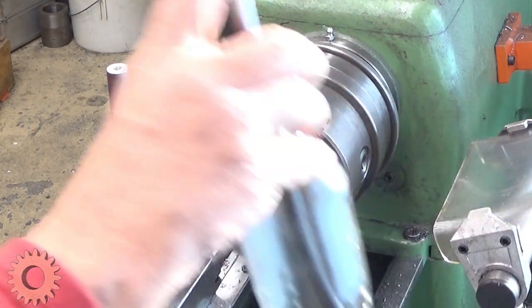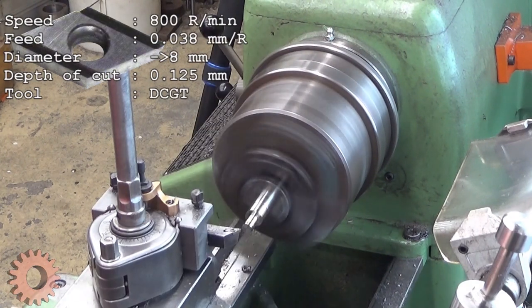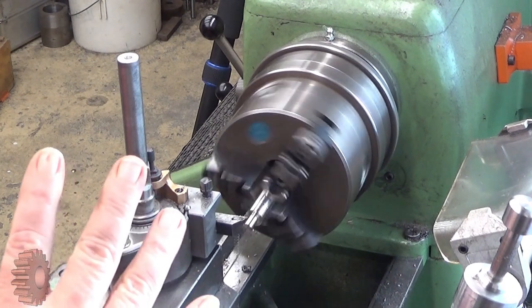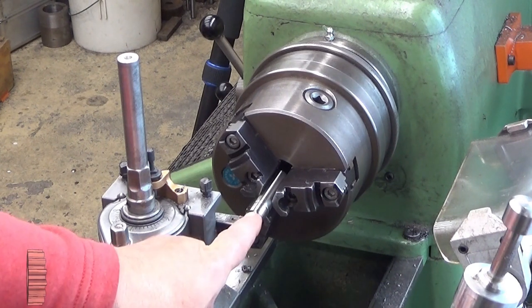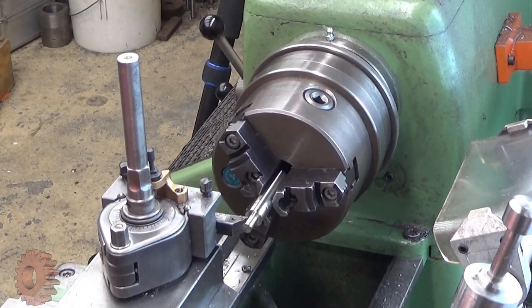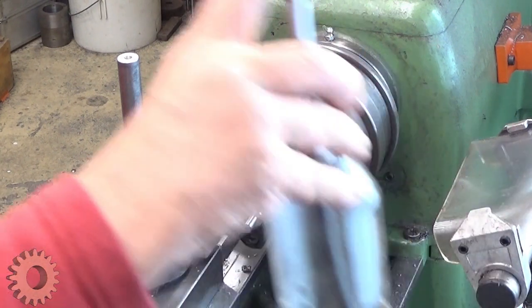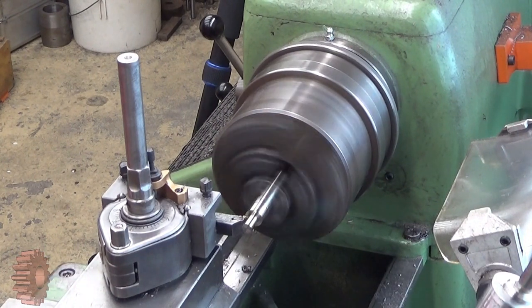This is now the last pass, so okay, I leave it there now, to lock the carriage here. Albeit it's really small, but we have a radius there in the corner. I don't want there to be any radiuses, because we have those pieces which don't have a radius and which should not be chamfered. So, therefore, I need to plug in just a little bit. Let's see now how this behaves.